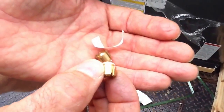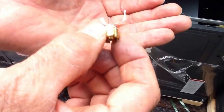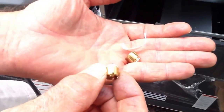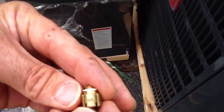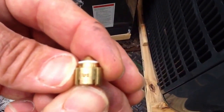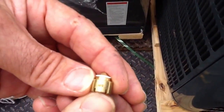Now, you can go within two piston sizes of the air handler. So this here — actually this 71 is fine. We could use a 68 or 72, but since I went through the trouble of pulling this out, I'm going to set the 71 here and show you this one — see, that says 70. That way I know I'm going to get the right refrigerant charge from the evaporator coil out to the compressor, and it's all going to work out perfectly.